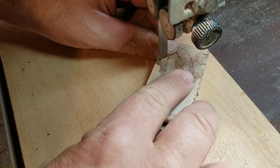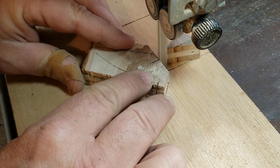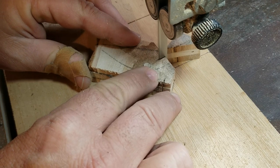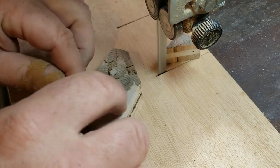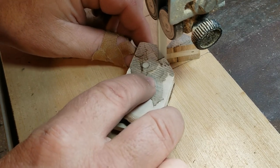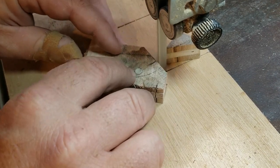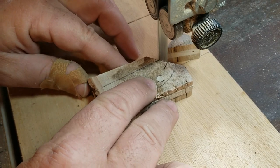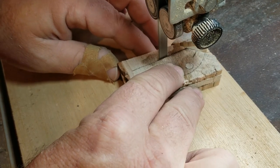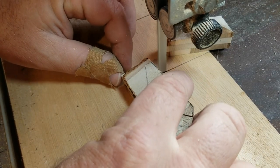The Band-Aid on my finger is from a paint can and not from the saw. Box store special bandsaw has got a lot of miles on it. It's not the most precise instrument in the world, but if you flip the lure and make your cuts from both directions, it kind of averages out the inconsistencies. Helps you center that lure slot, which has to be as close to square as you can get.